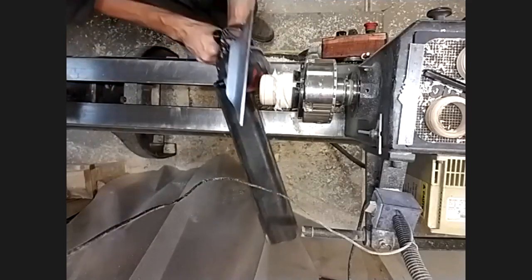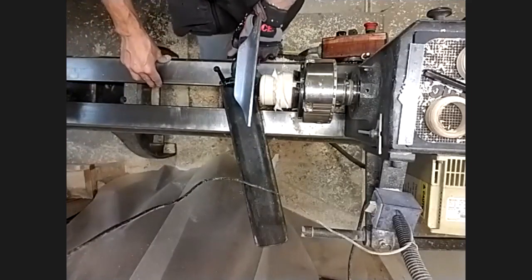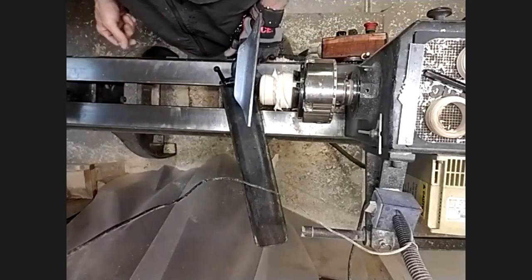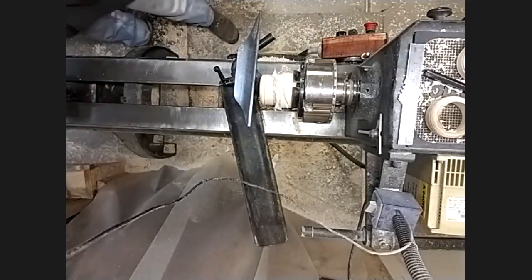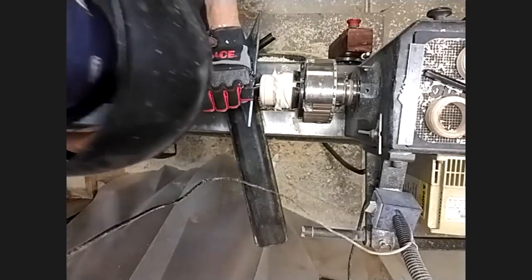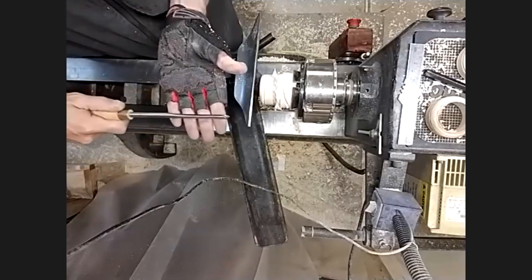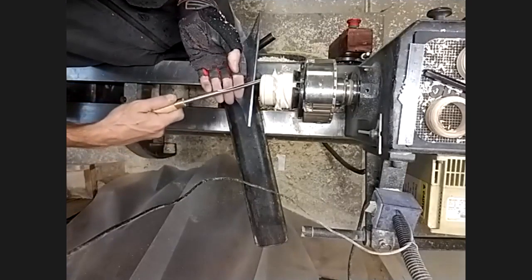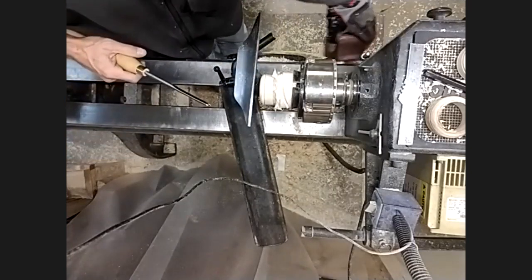Now, if you have a boring head, which I also have, normally what I would use is the boring head to go in and clean up your inside faces. But for purposes of this, grab yourself a quarter inch bowl gouge or quarter inch spindle gouge. You just want to gradually scrape inside, almost closed, for the flute. Catch that bottom wing, just a scrape on the outside. It'll bring it around to clean up the outside surface from where the Forstner bit cut.